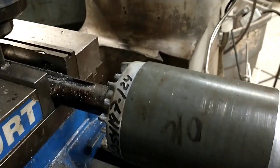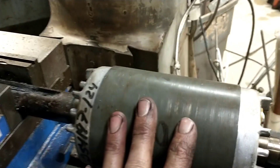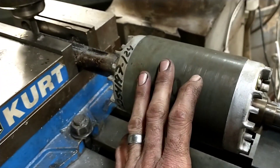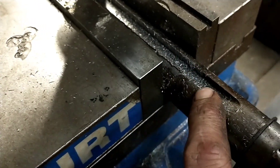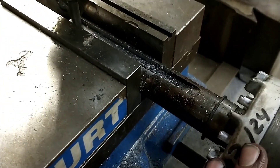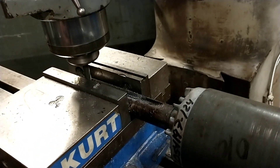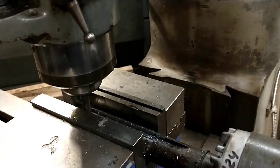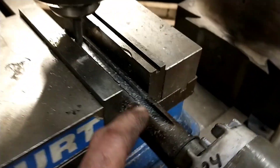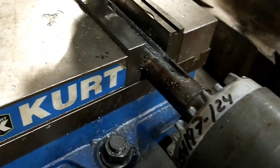Even the parts supplier we deal with doesn't even show this armature. So instead of putting a new one in, I brought it back. I was going to TIG weld it — the shaft itself is pretty good but it had hammered out the keyway. I was having some holy fits with the gas supply on my TIG, something's plugged up. So I ended up just MIG welding it, running beads along the two hammered outsides of the key.